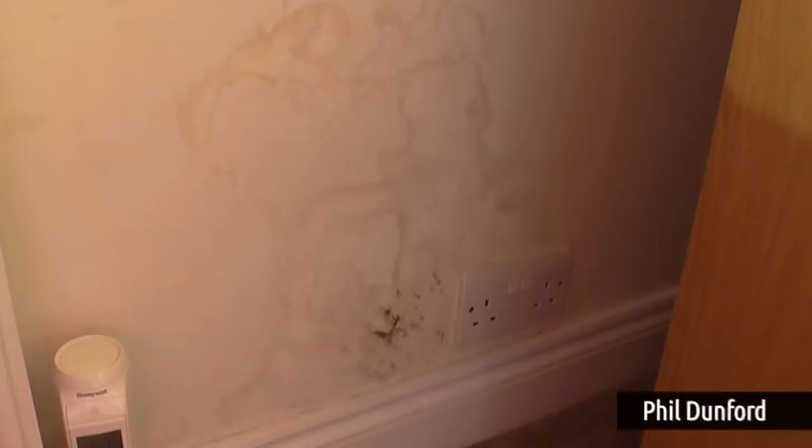A lot of people put patination oil on the front but not the underside of the lead — normally that wouldn't matter, but because it's cracked, the oxidization from the underside has crept up through the crack and appeared as a white mark on top. That's not the main problem. The problem is the lead has been put in too long a length. The only real solution is to take it out and put in code four lead in lengths not exceeding 1.5 meters.